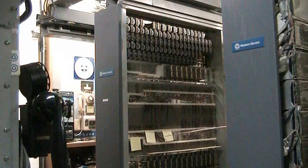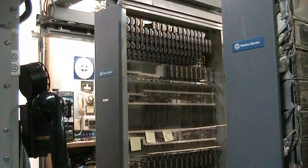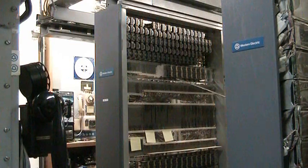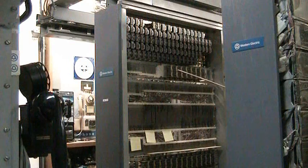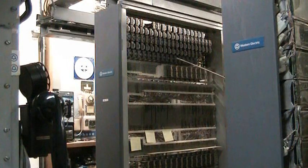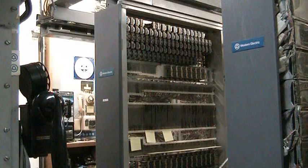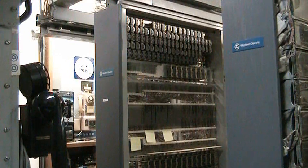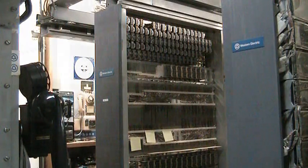There are two LNTs in this particular office. Each LNT's got 300 phone numbers on it, at least in the number 3 crossbar. So I have 400 lines, but I have a total of 600 numbers. The number 3 crossbar was originally designed for 2-party service or 4-party service. So someday I may try to wire up a multi-party phone line in the office. Where this was installed, they did not use any of the multi-party features.